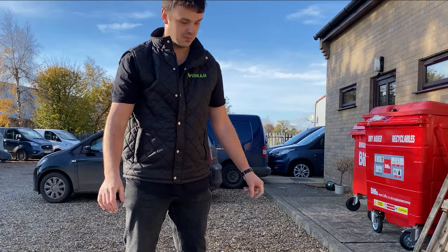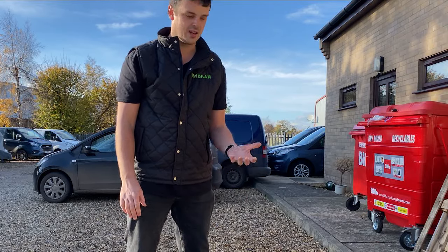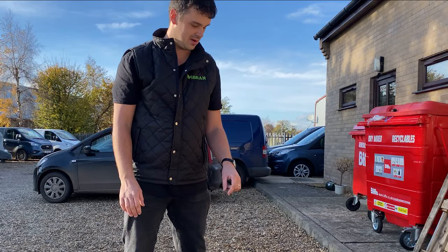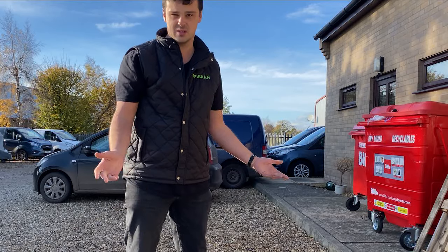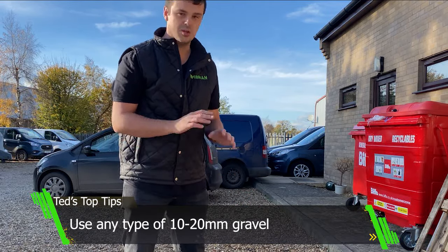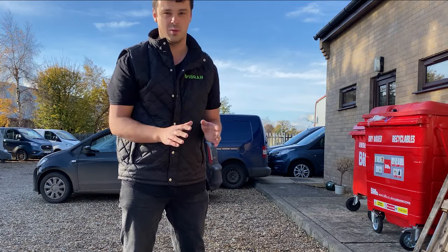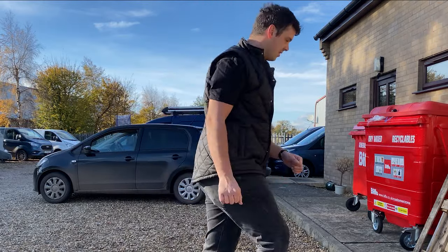Then you just want to fill it with gravel completely to the top — probably about 60 to 70 kilos to get it flush, a little bit more to get it slightly above if you don't want to see the grids. I'm going to use 20mm gravel because that's what's already here. You can use 10mm, 20mm, or any gravel you want — any shade, any styling. It's totally up to you and how you want it to look. Now I'm going to fill it up — that's straightforward.